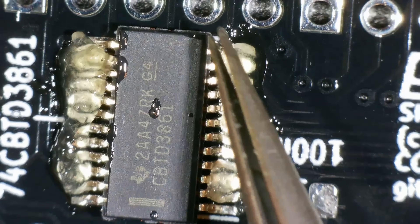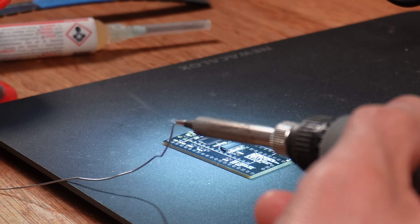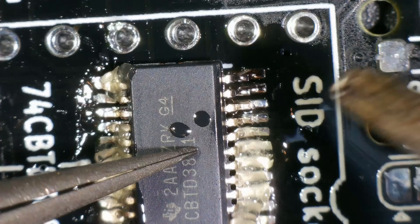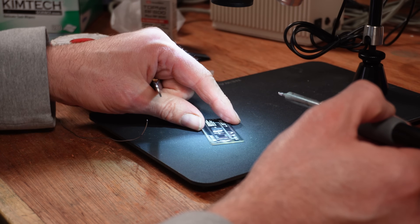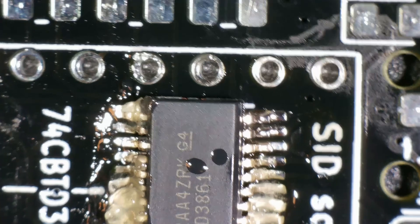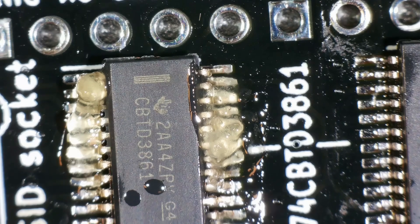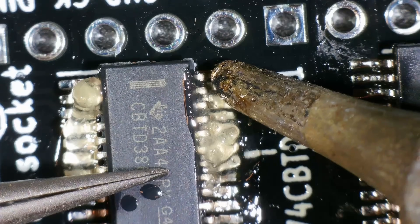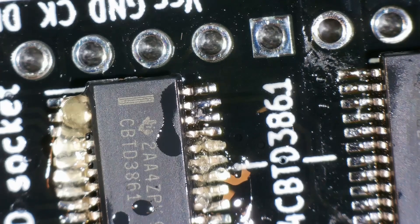On the plus side, the chip doesn't want to float around. With my soldering iron in my right hand, I add the smallest dab of solder to the tip, and with my left hand use tweezers to hold the chip in place. Then very carefully I touch the solder to the base of the pin and the pad in one corner, giving it time to heat the pad underneath. That's one corner fixed in place. I check everything is still lined up — if not, I can reflow that corner and nudge the chip into place. The good thing about this MG Chemicals flux paste is it doesn't immediately burn off like the Topnik liquid. I'm happy with the alignment, so I fix the opposite corner in place. Don't worry about bridges at this stage — they can be sorted out in a bit.